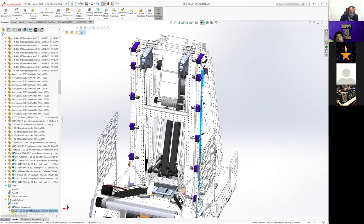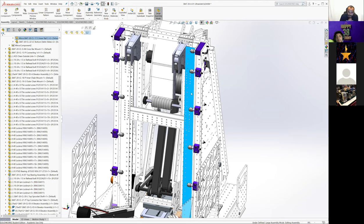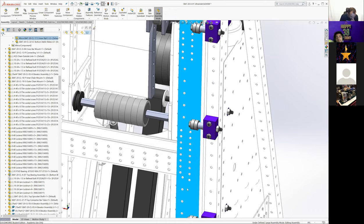So we looked at and got some inspiration from some of the teams in 2019 who built an elevator that could go down and help be part of their level 3 climb. I want to say 319 was one of those. There are a few other teams who did a similar thing, where they basically ran multiple sets of bearings like we see here up this one side rail, and this inner rail is just going in and out of them as it runs up and down. So this means if we need to put anything here, if we need to bolt to anywhere along this side, you totally can now. You can zip tie, you can do whatever you want, as you don't have any bearings running up and down this, right? You only have bearings running up and down this space.